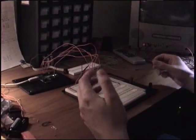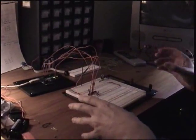And heard that noise. So that's what we do with that. And then we'll come over here to the computer. This is the Blink program, but what you're going to want to do first is, under your sketchbook, actually, the examples, go to Arduino ISP. You have the Arduino ISP here, and then you're going to want to upload that to your Arduino.